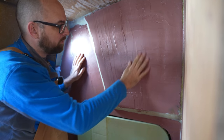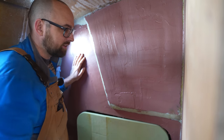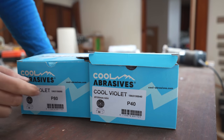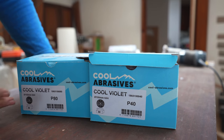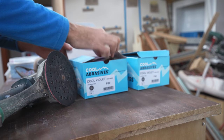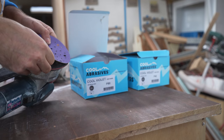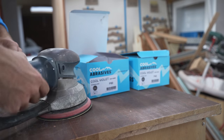Fortunately there is no blushing, so I can move straight to sanding without doing any kind of cleaning. For that I've got 80 grit and I've got 40 grit. At this stage I could use 40 grit, but I think 80 will suffice. These are smaller areas, so I am not going to worry about longboarding or anything like that — my 150 turbo here should do a great job.